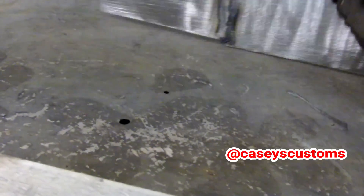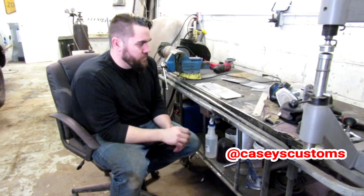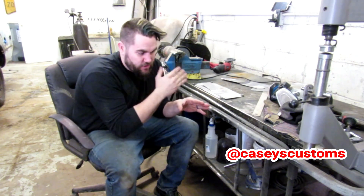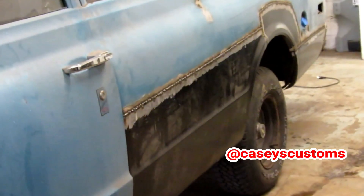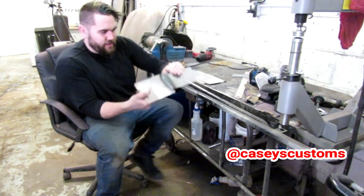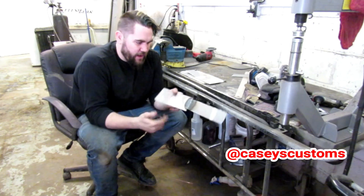Patience is a virtue when it comes to sheet metal work. The verdict is — we already knew it was going to warp — but there's a reason why whenever you're welding sheet metal you just want to do tack welds, let it cool, take 20 minutes, do more tack welds, and just do that until the panel is fully welded. This suburban I'm working on has about a thousand tack welds all the way down it — takes forever — but that panel is not warped at all, it looks perfect, just like it came from the factory. This solid full weld in one pass with no tacking or stitching is all kinds of jacked up — it's going to take a lot of hammering and grinding just to get it flat.